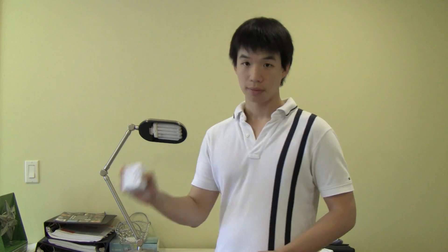To do so you need 3 really simple pieces of equipment. The first is your remote control — this costs about $5 and it's pretty self-explanatory. The second piece is your transceiver, which basically takes the signal from the remote and passes it along through the rest of the house. This costs around $10. The third piece is a lamp module, which sits on the receiving end of the signal — it's where you plug your lamp in, and once it receives a signal it will turn the lamp on or off.